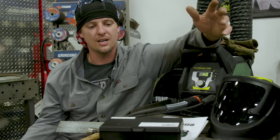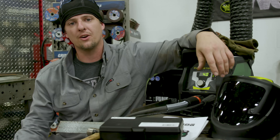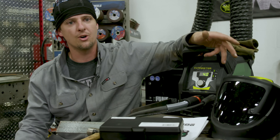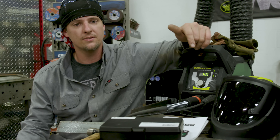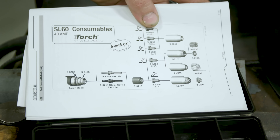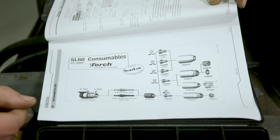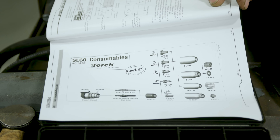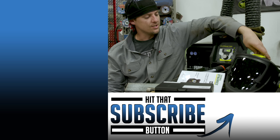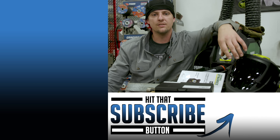There you guys have it — that's the Cutmaster 40 amps. I was pretty impressed. We cut one-inch material. A couple of things I like: it's light and portable — you don't have to have a dolly or break your back. Second, you don't need all these buttons — you basically plug and play with one knob, turning from 15 amps to 40 amps. I recommend getting a little air dryer, which makes your consumables last longer by removing moisture. Also, I ripped the part list out and taped it inside the machine so you stay organized and can reorder consumables easily. This also came with shade 3 and shade 5 lenses, so you don't have to buy them separately. I really like this machine. Thanks for watching guys — stay tuned for Mondays and Fridays. Learning is key. See you next time.